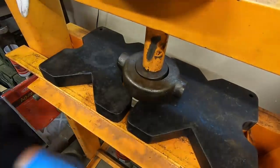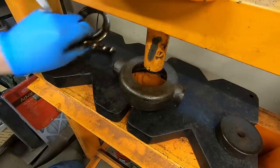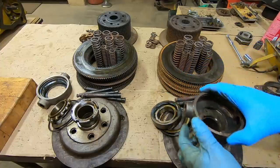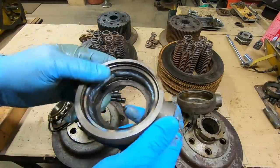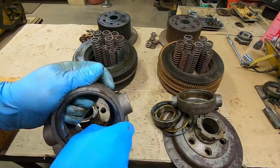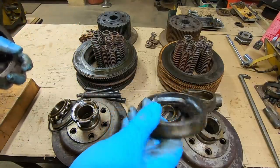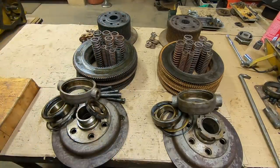We're actually pressing this one out... it still fell apart. All right, everything's cooled off — we have that bearing out. Welded a bead all the way around and it's loose in there. We worked it out — pulls right out by hand. That is a slick way to remove bearings, too bad it ruins them. Steering clutches are completely apart — be sure to keep that nut with that hub.